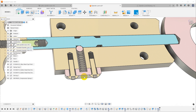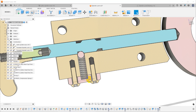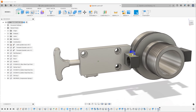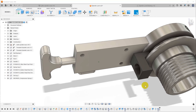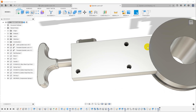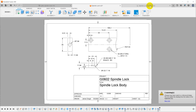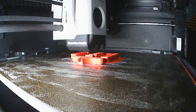To retain the spring, I've got a plastic cap that I'll just 3D print, designed with a little pocket to hold the end of the spring. If I need less spring compression, I can make the cap taller with a deeper hole; if I need more, I can put a little pin on it that extends into the hole. I also designed a drill jig that fits tightly against the spindle nose, which I can clamp in place as a guide for drilling holes in the headstock. I'll create mechanical drawings and 3D print prototypes first to test the fit before making parts in steel.